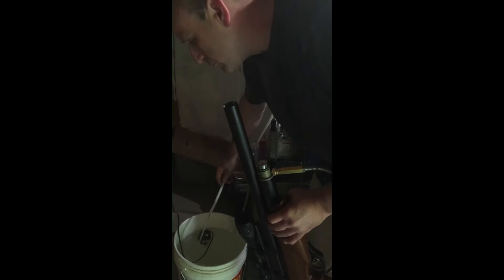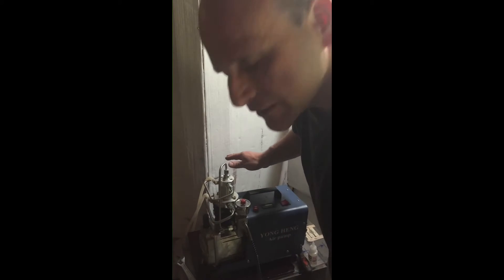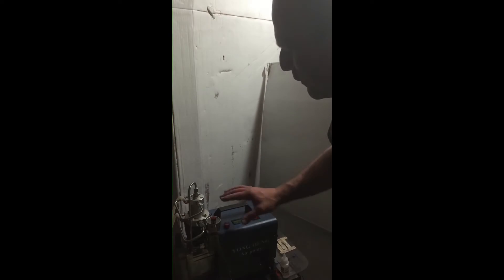I'm going to put in our bleed valve and tighten that up. Some important things whenever you use your compressor: check your temperature gauge — right now we're at 20 degrees Celsius, nice and cool. You don't want the compressor to get hot. Make sure you've got good water flow, it's water cooled. Check your gauges, make sure your air pressure is where it needs to be. Once you've checked everything and it's all tightened up so you don't have any leaks, fire up your compressor watching your gauge. It has an automatic shutoff, but I like to keep control of it.